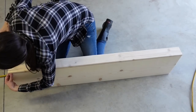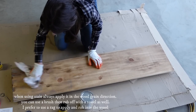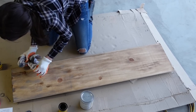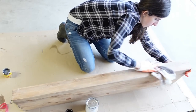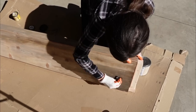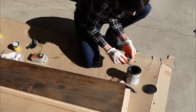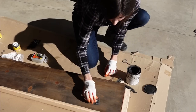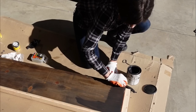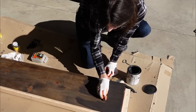I used three different color stains on the wood board and just didn't like the color it came out — I really wanted it to match my floor and couldn't get it right no matter what type of wood I used. So in the end I decided to scrap the lighter wood option and go darker. I tried ebony color stain and didn't like it, then dark walnut which was a little too red, and then I found a color-matched stain from a couple years ago for our cabinets in our last house — it was the perfect color. I finished all the rest of the boards and it's going to be the next day when we work on the decor accents.